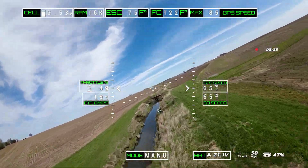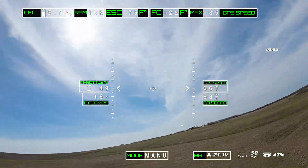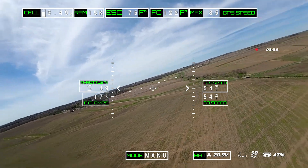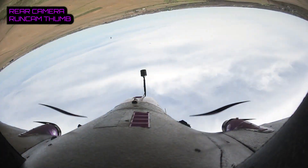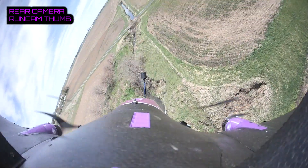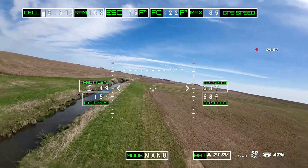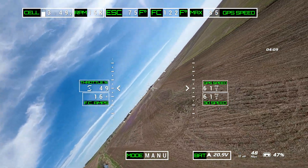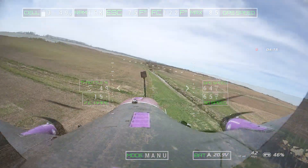I'm just running it low — the ESCs are staying at 75 degrees, no problem, not getting hot whatsoever. The flight controller though is getting a little toasty — if anybody knows what the safe temperatures for a flight controller are in Celsius or Fahrenheit, let me know. Flying inverted — she flies good. I might need to add more venting, but at around 120 degrees Fahrenheit it seems fine. That's pretty much where it stays, and I've had the throttle set at 50% for the most part, pulling anywhere from 15 to 17 amps the whole time.